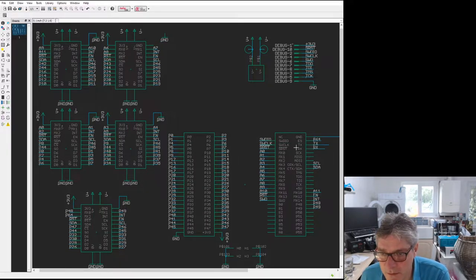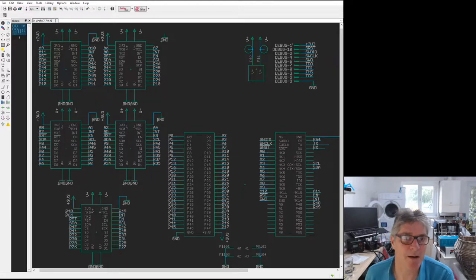In addition, some of the IOs that are left on analog, well, mixed signal rather, I'm using to drive control signals like reset for the tiles, so low reset, and enable, which can be used like a power enable. My thinking here is really just so that we can power down a tile or set of tiles if we want to go into a low power mode, really.